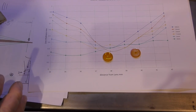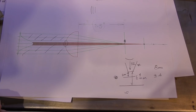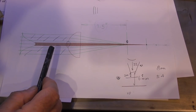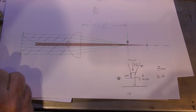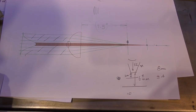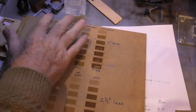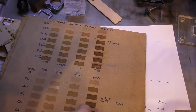This clearly demonstrates that there are two distinct features within a lens. I'm pretty happy in my own mind that this is how lenses operate for cutting with these machines. But when you're engraving, you can assume the normal focal point pattern exists — but remember that within that normal focal point there is a little spike of energy which could annoy you, because when you are trying to engrave you normally only want to burn the surface. You don't want to dig into the surface, and this spike will cause you to dig into the surface. I've got good examples of that when I tried to do some matrix burns to find out what color I might get at various speeds and powers.